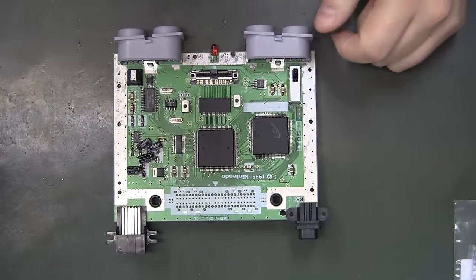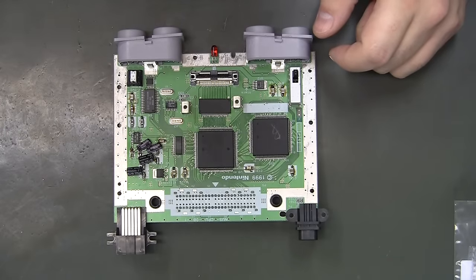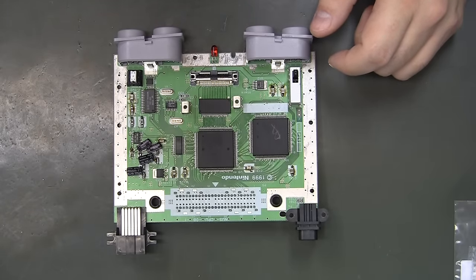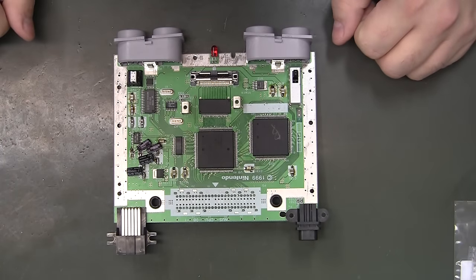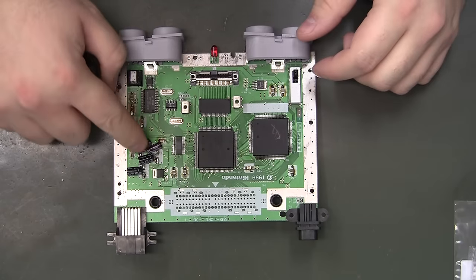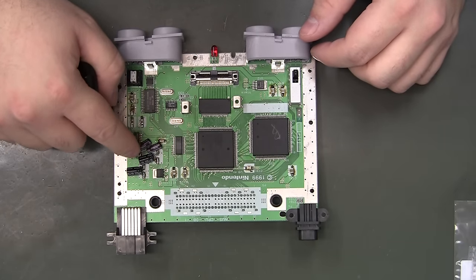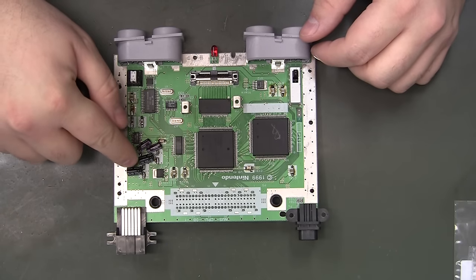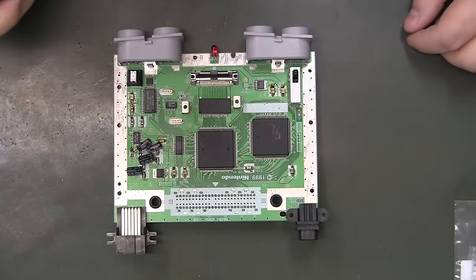At this point, I'm going to re-clean the board, get all that flux off there, and I'm just going to use rubbing alcohol to do so. I've got some higher percentage stuff in there than what it was advertised as. And then I'll do the Ultra HDMI mod. By the way, these were all Nichicon, sourced from Mouser, so they're known good quality, low ESR, high temperature caps, and that's what I'll be putting in the kits.